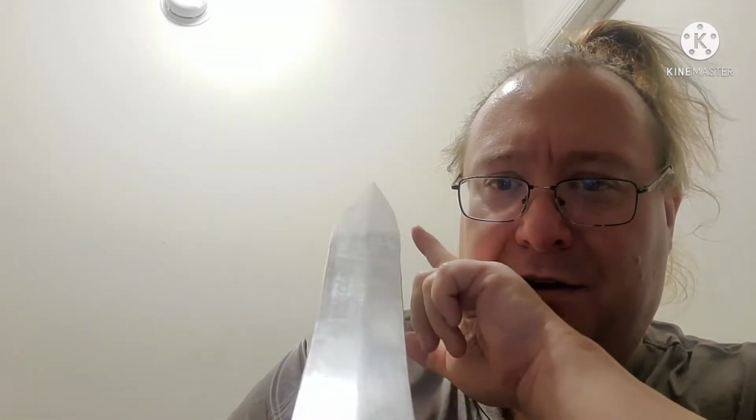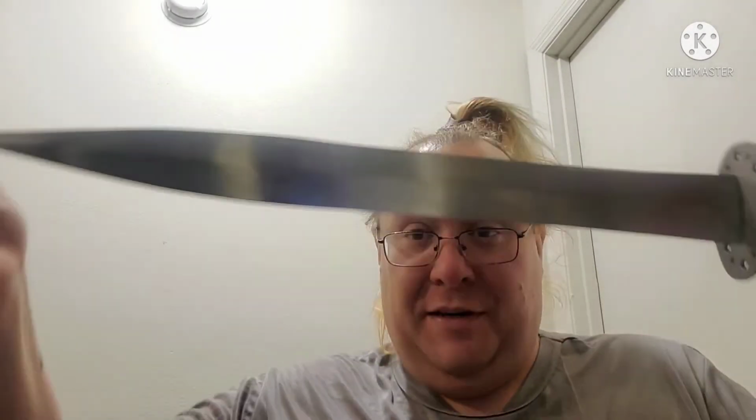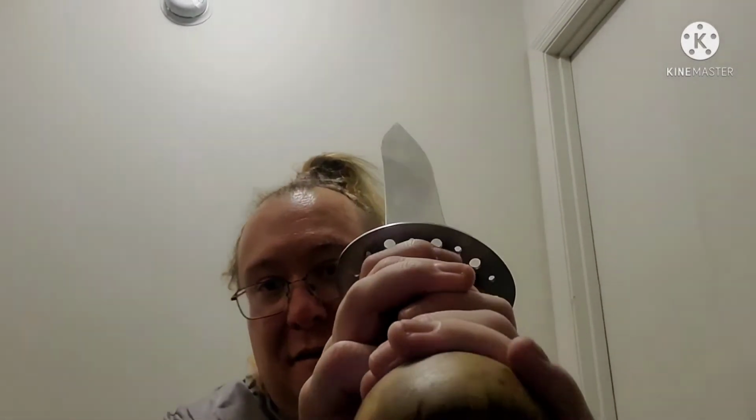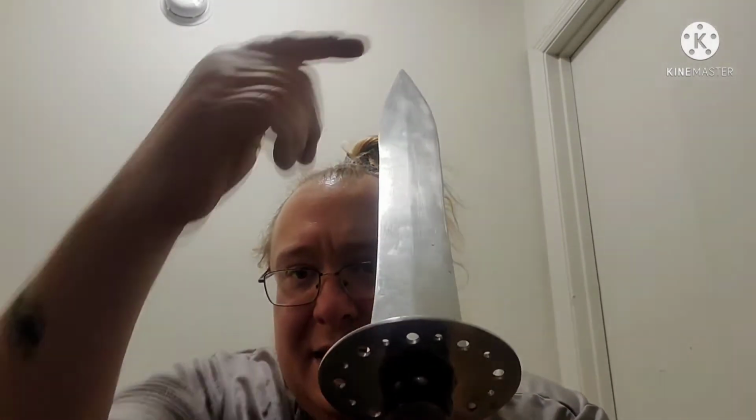Yeah, you'll see that the blade sides don't quite line up. This side here is definitely cut in more. I think that's because I used one of those hand tool sharpeners like a lot of people are saying to use on swords these days. Yikes. No, they take off way too much steel. And because of that, in my sharpening, when I was learning to sharpen, I'm still not great at it, but back in the day, it took off way more steel on this side than that side. And now it is slightly misshapen in the blade, if you look closely.